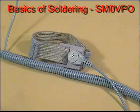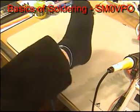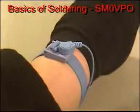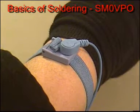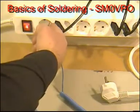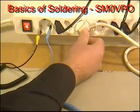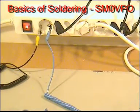If you do not want to have this coiled lead lying over the work area, then you can also wear it on your ankle, or stuff it down your trousers if you feel so inclined, as long as the strap makes contact with naked skin somewhere. Your soldering iron must also be earthed to the same earthing point as the mat and yourself. If not, then several hundred volts of leakage current could be present and your iron will be converted into a voltage weapon that kills circuits on contact.